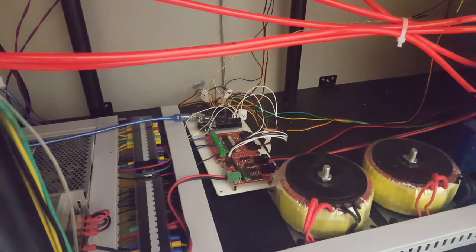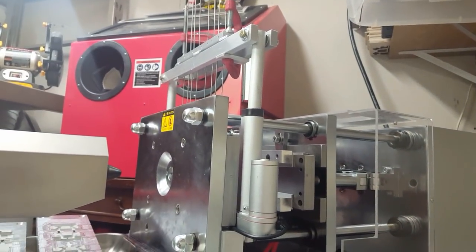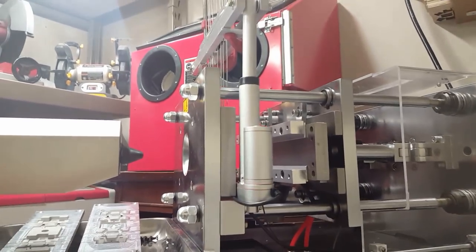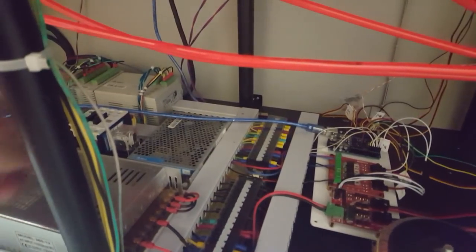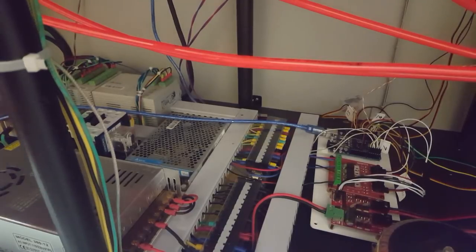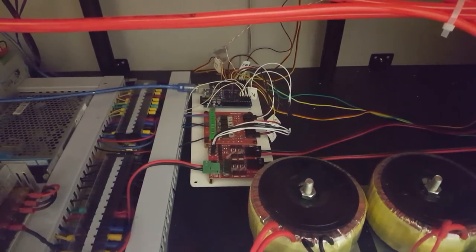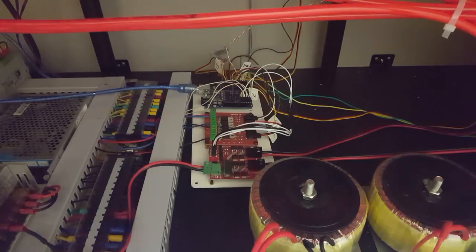And then all the stuff on this white board here, this is everything that I had to add. So like I was saying a second ago with the pin pulling device, I needed to make sure that the mold would not open if the pins were down. So I had to tap into the main controller unit and see when the controller tells the mold to open. And then I used an Arduino, and the Arduino actually took over control of the mold closing, took over control of the safety door, and the ejector pins to actually pop the part out of the mold.